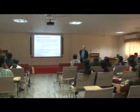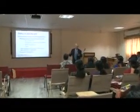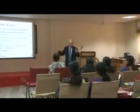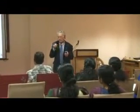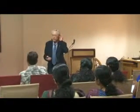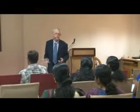The familiar key interlock that you've got: two breakers and a tie breaker, and you have two keys. You can only close two at any one time because you do not wish to parallel. Or you have a sequence, and until you take the key, open this breaker, take the key out, put it in that breaker and close it, you can't. It's a very effective system. It doesn't show up on the one line.